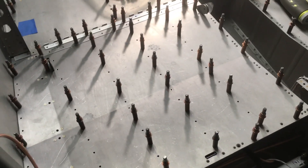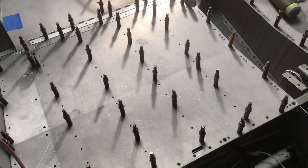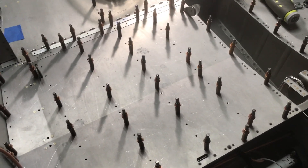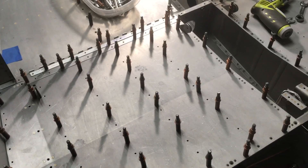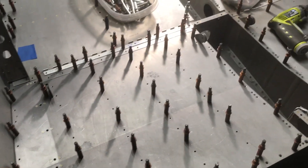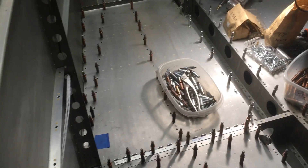One of the things that slowed me down was I had not yet match drilled the holes — I didn't realize that. So I was about to start, and when I tried to put CLECOs in, if the holes are not match drilled for eighth inch, they undersize these, so the CLECO really won't go into the hole very well. So I had to take stuff apart, actually match drill it, then take it apart again, then deburr all the holes. So that's where we're at, getting ready to do that.